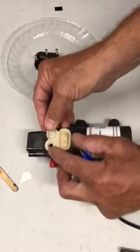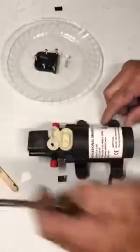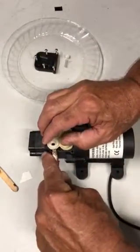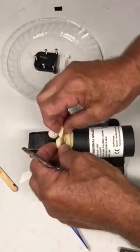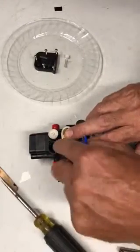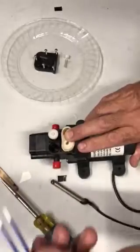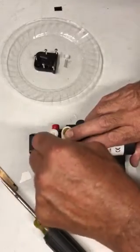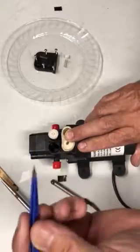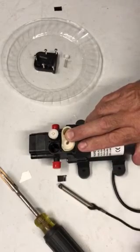Now if you're looking straight down it's different. I'm going to pull this back — this is how I got it out; it's wedged in there really well. With the screwdriver, which is really dull, I push in from the side and I'm able to pull it up and work it up like this. You have an inlet and a discharge here. I'm going to look for any kind of debris with my tweezers — it could be hair, a piece of grass, anything that got pulled into your diaphragm. I'm shining a light in there and picking out whatever I can, and that usually solves the problem.